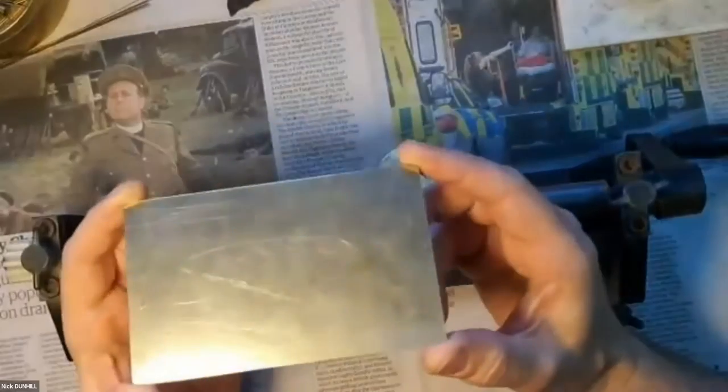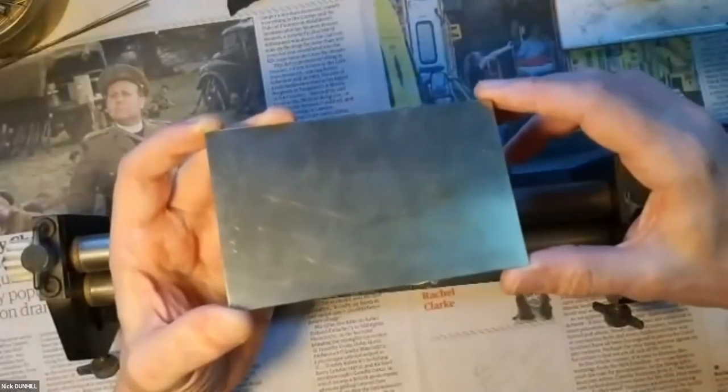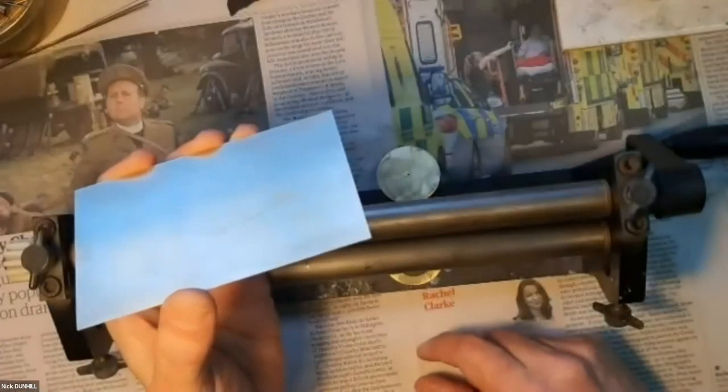This has been cut from 0.3mm nickel silver. I like making the wrappers from much thinner material than you'd normally get in a commercial kit - usually kits come with 0.45mm material, sometimes pre-rolled. I find hobbyist slip rollers struggle a little with 0.45mm material, so to get a nice cylinder I always choose 0.3mm, which might seem thin but once it's been rolled into a tube it has quite a lot of strength.